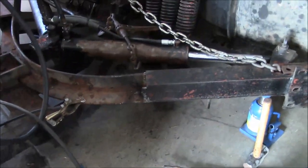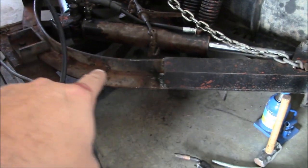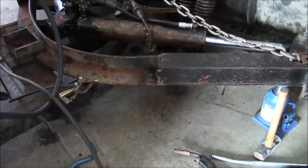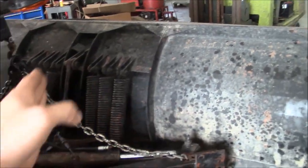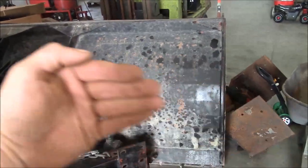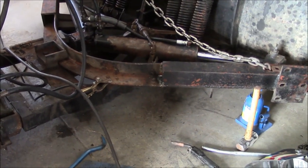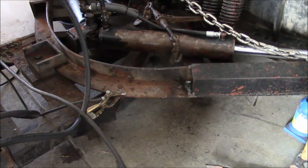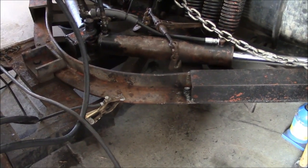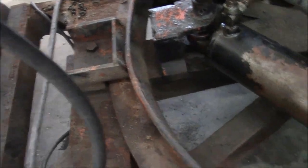It's not perfectly straight — still has a bit of a bow. It's actually straight right here at the bend in the angle iron, but the rest of it's kind of all out of whack. This is the spot that takes the most beating because normally the plow would be angled to push snow off toward the right side of the road. So of course it's going to get the most wear and the most hits there. I don't think it's going to be worth my time to try to straighten that further. We might be able to plate it on the back side, but we can't plate here because of the shoe that it rides.